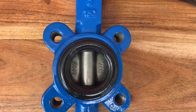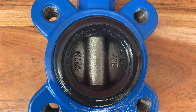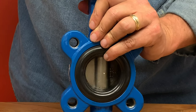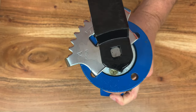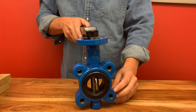The butterfly valve is designed to do three things: to start the flow, to throttle the flow, and to stop the flow. Butterfly valves have a short circular body and a round disc with either metal to metal or a soft seat. Similar to the trunnion ball valve, the disc is on an anchored stem, so the disc pivots as it is operated. The valve may also be opened incrementally to throttle flow. Unlike a ball valve, the disc is in the flow path and the pressure drop is a lot greater.